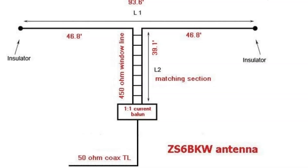I think one of the most notable modifications is from ZS6BKW. He set about trying to improve the matching in order to get the VSWR down, and he succeeded in doing that. He didn't do much for the 80-metre band, but he certainly got 40 metres and 20 metres down. He also managed to get a decent match on 17 metres. 21 MHz — 15 metres was not a goer with his revamped design. 10 metres was okay. If you go on the internet, you'll find details of the ZS6BKW modification. All credit to him because he did do an awful lot of work.